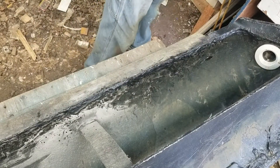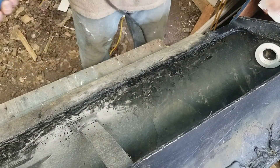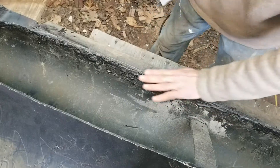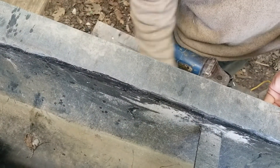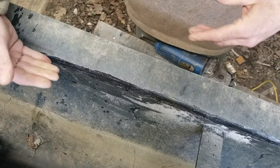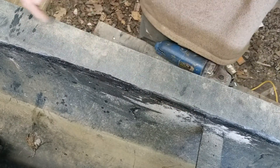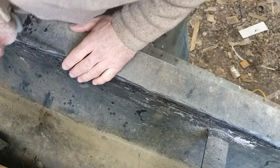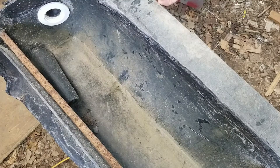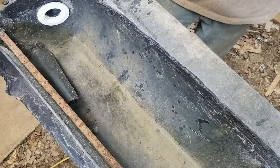I'm going to get my wheel here and clean up some of this edge — it's just because I want it to look good. If I can get most of the rough stuff off the top of this, it's going to reduce turbulence, and then you're going to get a much more even flow. If water has to go over bumps and ridges and things of that nature, it creates turbulence and you don't get a nice even flow. I want like a half an inch thick of water coming out of here, so I have to put a side up on this, otherwise it will just flow off the end.